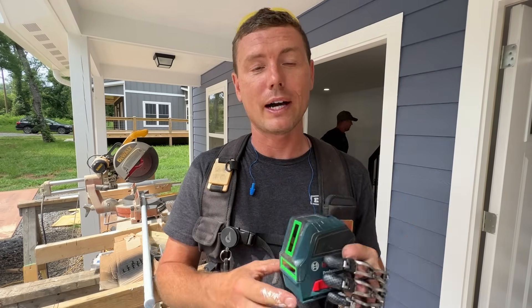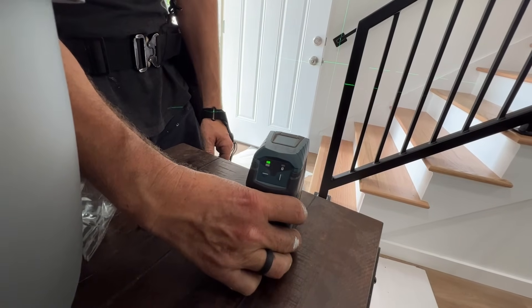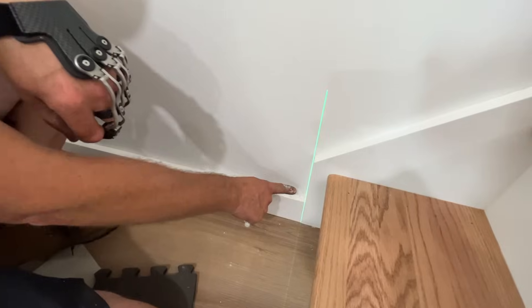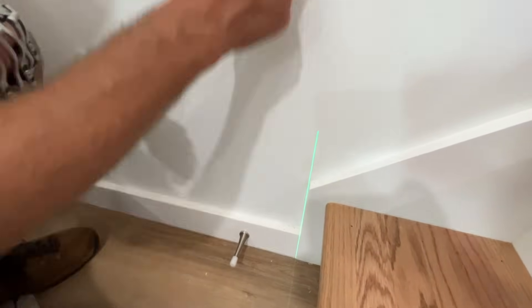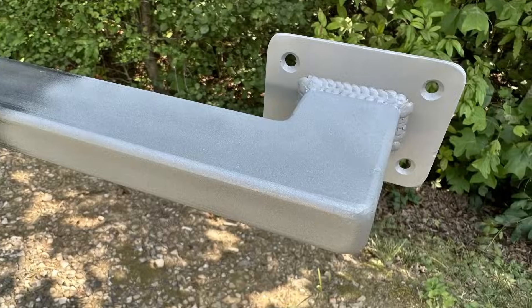The plywood spacers take care of elevation up and down, but for left and right I'm using a laser aligned with the position of the skirt board — that gives me a line on the wall without drawing pencil marks or using painter's tape that could peel the paint. My favorite part of these metal handrails is at the return where it meets the wall — there's a bolt flange with four screws, so even if one misses you've got three more tries to hit blocking. I missed one and had to use an anchor, but the other hit, so it's plenty strong. This rail is 15 feet long; I used four additional handrail brackets screwed to the wall and into the bottom of the metal.